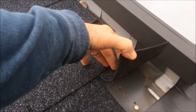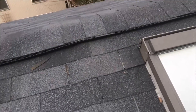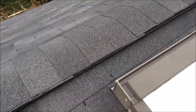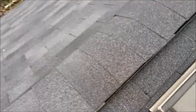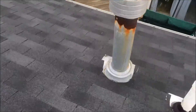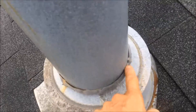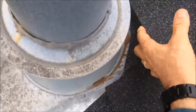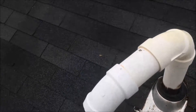Here's another one — all the skylights are exactly the same way, so we need to take up the shingles around all of them. In order to remove all the shingles around the skylights here, I need to take the ridge vent off and also the cap shingles so I can get the ice and water shield all the way up. Then we'll do the roofing and reinstall the ridge vent and cap shingles. This back pipe here is leaking as well — the flange here is just wide open so water is getting inside. They nailed high on this one so that's not a problem; I checked that pipe flange and that one's okay.